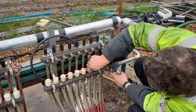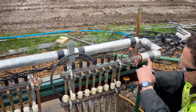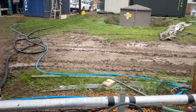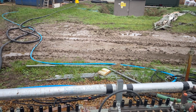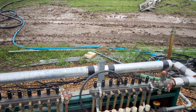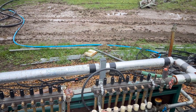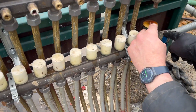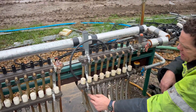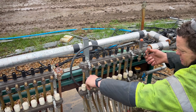Which one's that? That's the bottom one here — it's flowing alright. That'll be coming from the header. I think it's coming from our process building now as a shortcut. There's pressure on both system ends. I just want to make sure that each of these is flowing. I've shut all of these valves except for that one, so the only way that water can get through is around there, down here and out. Turn it off — they're all off.